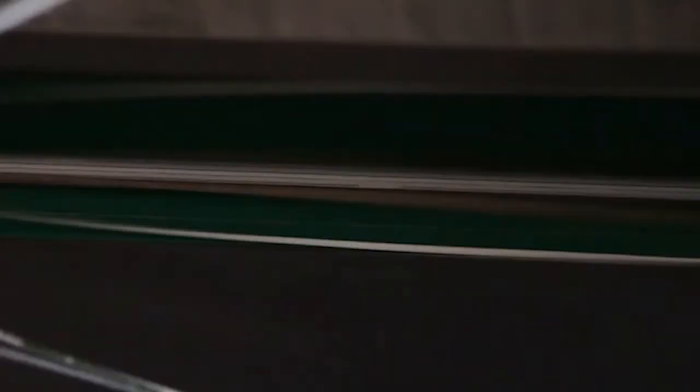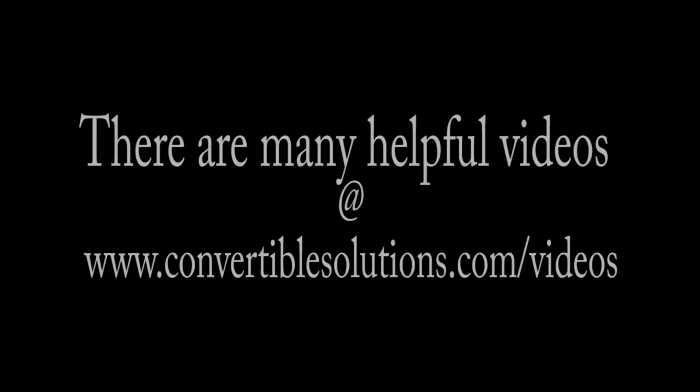One of the big challenges that customers have asked us to demonstrate and help them with is chipping or chatter. This is the area around the edge of the sheet, or the final card, that tears away just a little bit. One of the requirements to eliminate chipping and chatter is to have a back trim — a second trim — on every single multi-loft sheet. We recommend cutting 1/32nd of an inch off the sheet for your final trim. This will help eliminate the chatter.